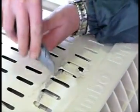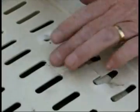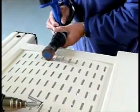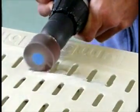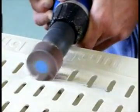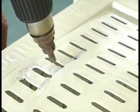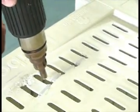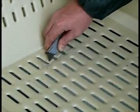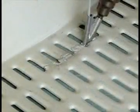When the welding process is complete, trim away all the excess pieces. Sandpaper can then be used to smooth the surface of the welding area. Once this is complete, use the welder to make the sanded surface smooth again. When the outside is complete, trim the weld on the inside of the bin and weld all the areas from the inside of the bin as well.